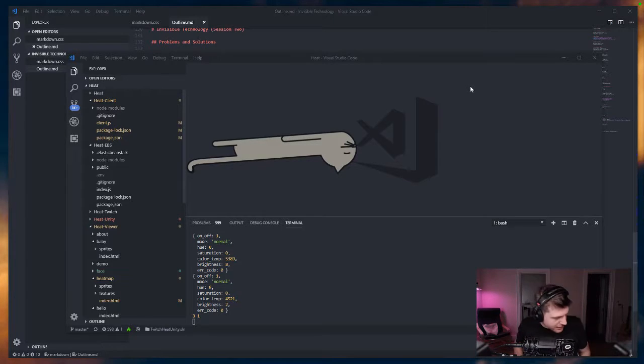So we need a quick sketch for the piezo, and we need a quick sketch for the... I had some resistors somewhere. I've lost them all. I need a megaohm resistor, which I forget the colors for. Totes my goats. A megaohm resistor is brown, black, green. Brown, black, green.